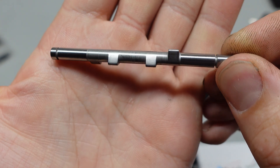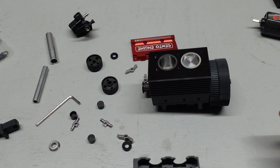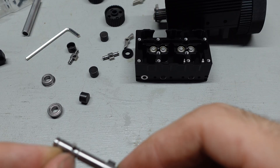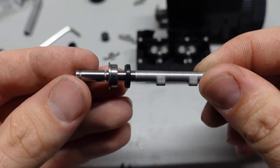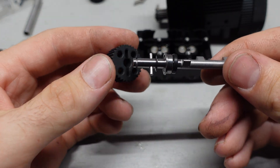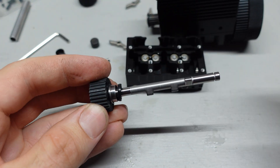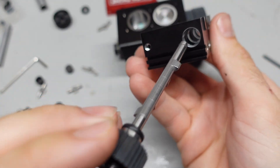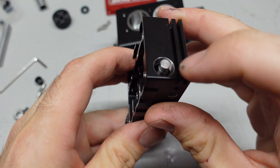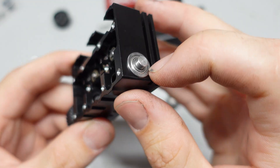This is what the camshaft looks like — the smallest little baby camshaft in the world. The instructions tell you exactly how to piece it together: a pin goes on with one C-clip, slide your seal on, bearing goes on, first C-clip, then the pin, then the cam gear — the one with the little cutout for the pin — slides together and that's our completed camshaft. We put it in the cylinder head from the front, work it in with the seal, add the other bearing and C-clip and seal on the other side.